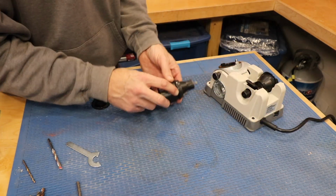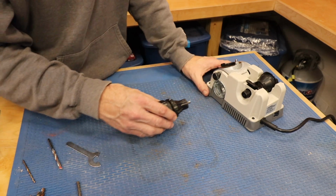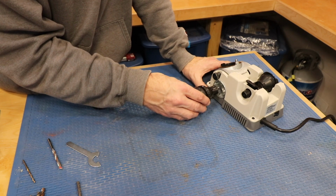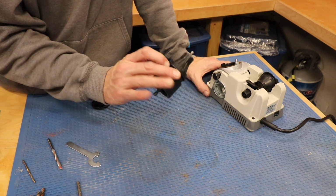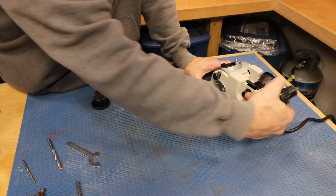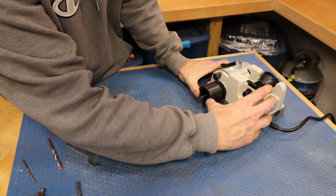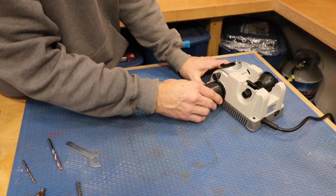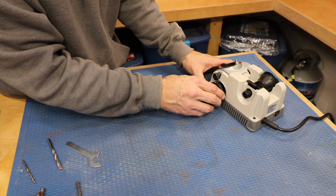So we're going to turn that on. What we're going to do is put that little white tab right there aligned with that. And all you do is just push that in until the grinding stops, just kind of lightly go in, and then take it out, rotate it 180 degrees, do the same thing, and then you're done. And your drill bit's all ready to go. So watch. Turn it 180.